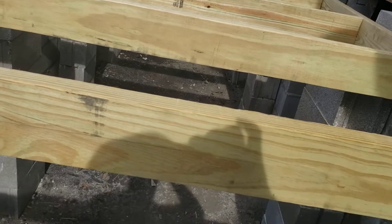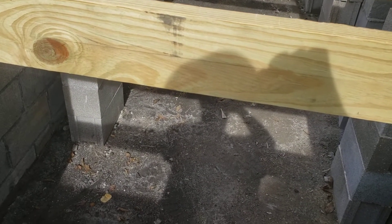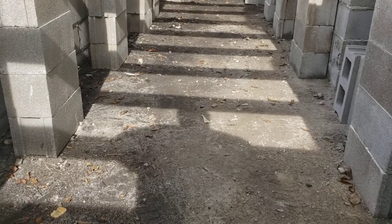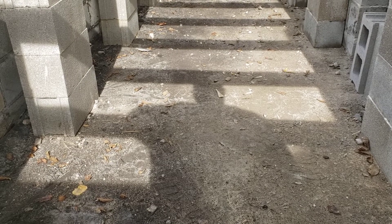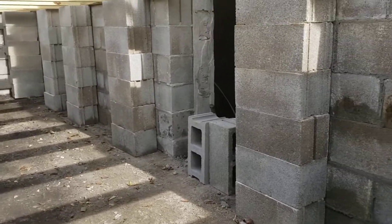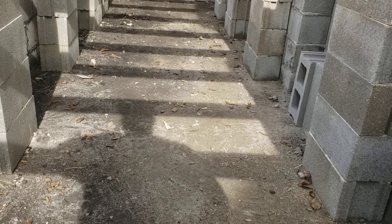What I've done is, we got this finished digging out, and there was no foundation for the porch. So I came in and had concrete poured for a slab foundation. I could have done just a pier foundation, but I wanted to use this for a storm shelter or storage area. I had a door cut into the foundation for access from the inside, in case of a storm.